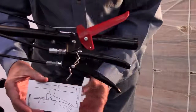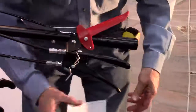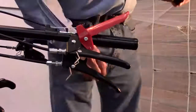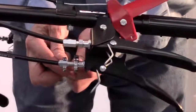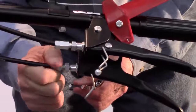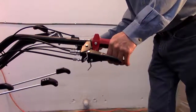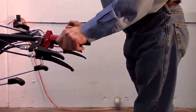Moving on to the clutch cable. In standard models, check that you have free play in the lever at the bottom of the arc before you feel resistance. The vertical measurement from the depressed OPC handle to the point at which you feel resistance should measure about 4 to 5 inches. If your customer has small hands and you want to maximize the amount of free play, loosen the set nut and screw the tube clockwise a couple of turns, which is inward. Put the wheels in low gear, release the clutch and then squeeze it after traveling a couple of feet to see if the tractor comes to a complete stop. If so, you're fine — tighten the nut against the bracket of the lever. If not, if there's a creep to the wheels, reverse the procedure and turn the tube counterclockwise, or outward a bit, and try it again.